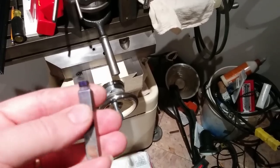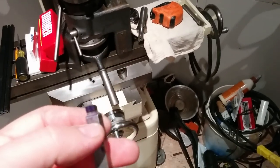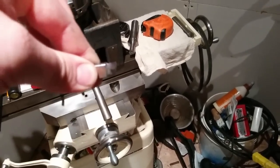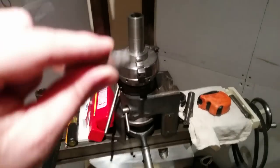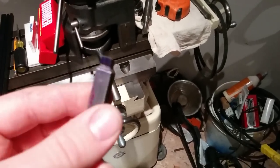Now what I'm doing is drilling the hole in my cutter holder. I need to drill a through hole and I'm going to use a 10-32 and thread that up into my cutter. I'm going to cut on the downstroke. And there you go - it's getting real folks. Talk to you soon.